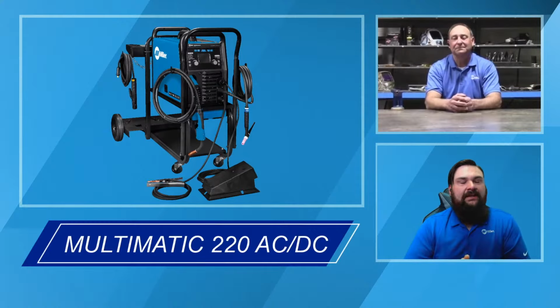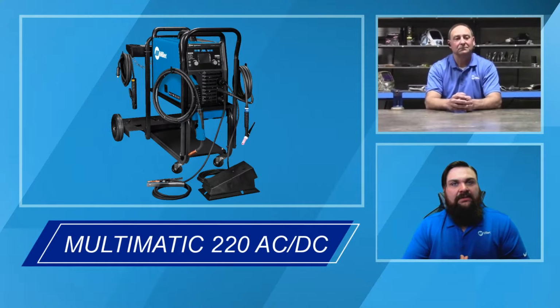Right. Like you said, they're basically going to compensate for any power that you give them to a certain degree, where, for anybody who's familiar with generators, that power is not perfectly clean. Even on the newest of generators, it gets a whole lot better than it used to be, but there's still what they call dirty power. So you've got spikes in there where your power is not always perfect. On the older style machines, if you hooked those up to a generator and you were welding through that peak or valley, you're going to see that in the weld output, where these newer style inverter machines will actually level that, take more of an average look at the power, and you're going to have a consistent output no matter what your power in, to a certain degree, looks like.